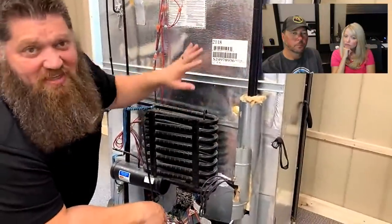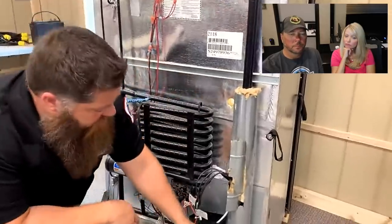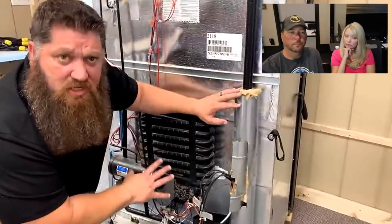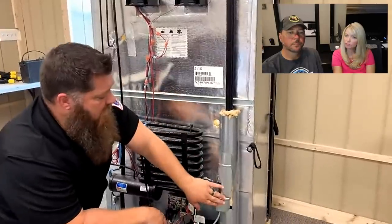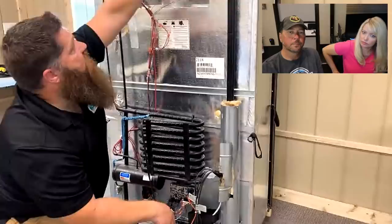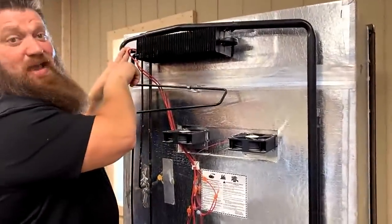Okay, well, there is no refrigerant in the system. We're actually just introducing heat. And so we'll either use it by propane or by these heating elements. Now there's a couple chemicals that we add in here to create the freezing. We're taking water and ammonia in liquid form and we're heating it up. Let it boil and it comes up here. This is our first heat exchange. We want that ammonia to turn back to a liquid.